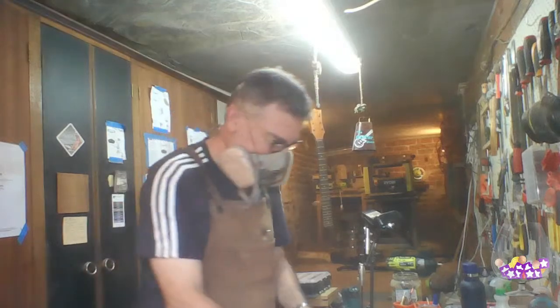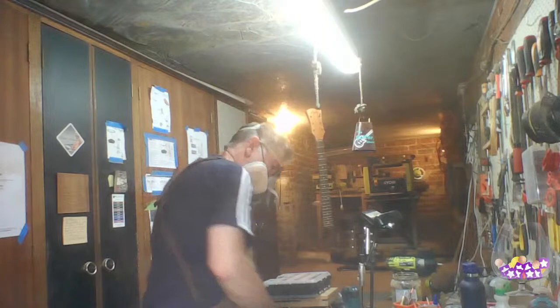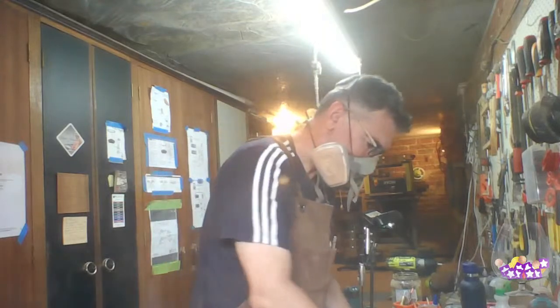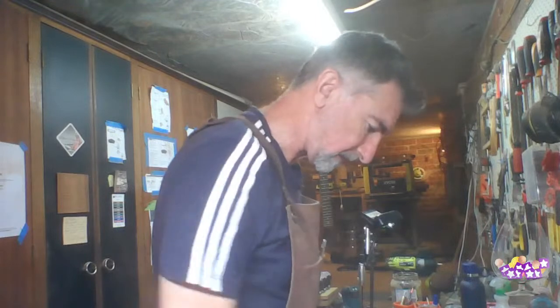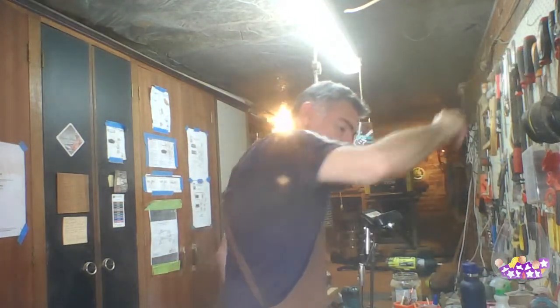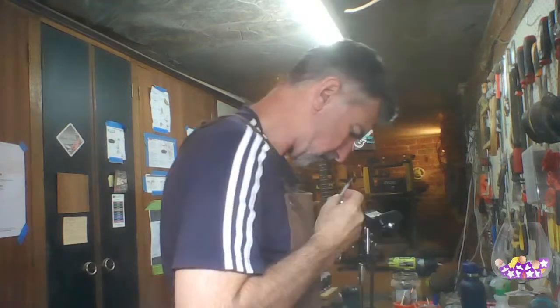Right, this will get us started. So let's put this neck away. Actually, no, let's not put this neck away. We need to measure up the outside edges of the string line, and then we're going to use our fret calculator, our nut slot calculator to work out where that's going to go. Let me put some of this stuff away in my top pocket.